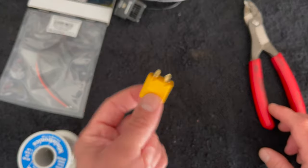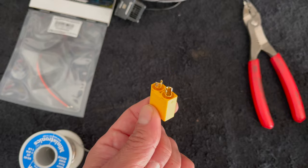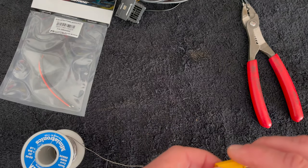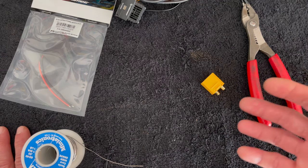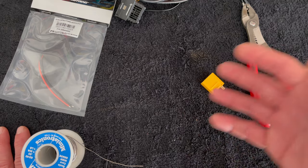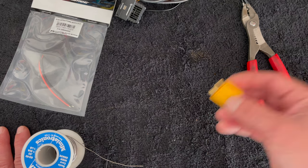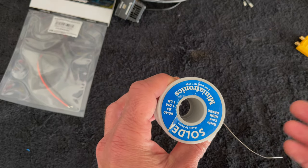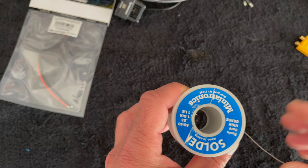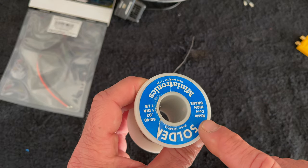When you are going to do power plugs, make sure that your plug surfaces are bigger than your wire, otherwise it's going to act like a resistor. I keep running into folks that are still using undersized plugs for their applications - running big power setups using either standard TRX plugs, Dean's plugs, or they have adapters involved - that's also a very bad deal. Just make sure that you solder on a plug that's big enough to do the job, larger than the wire being used. A lot of times you're going to find lead-free solder out there - if you do, get a little bit of flux, either flux paste or liquid flux.